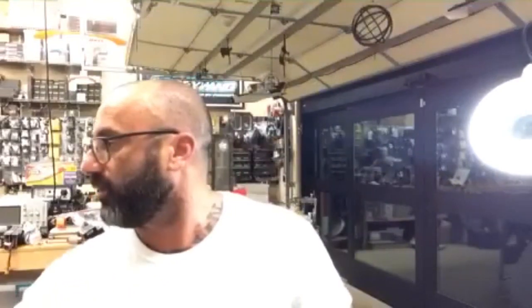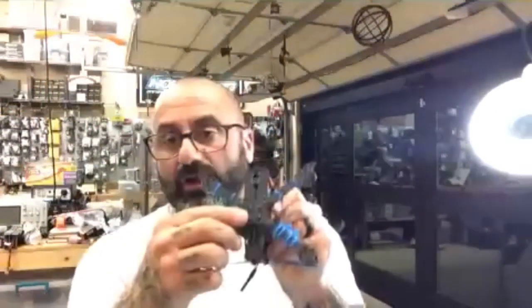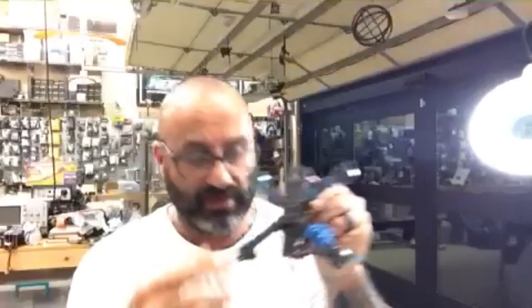That's in the center of those four, and that is a tiny tip, right? So my point being is it's balanced. That's what tells me if I like a frame or not, and I'll post this picture up later on. I don't think it's going to help if you even try to see it this way, so I won't waste any more of your time. But point being is it's centered very well, it's weighted very well, and the center point was between these four screws right here. So somewhere in there with this fine tip, it was able to balance. So I'm happy with that, okay?